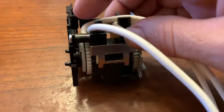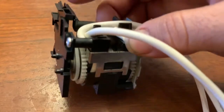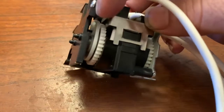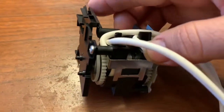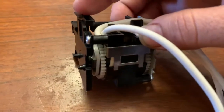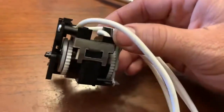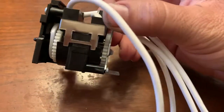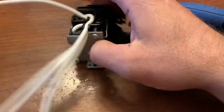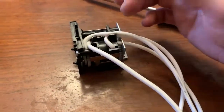The important thing to check is that when you're moving this wiper module back and forth, the wiper arm, that white thing inside there, is still moving with it. Or else your wiper system won't work, it won't clean, and you'll have to take everything apart again, take it out and redo everything. So just make sure it's back on there. So that's the best way I can explain replacing the tubing.